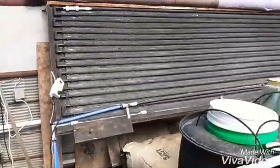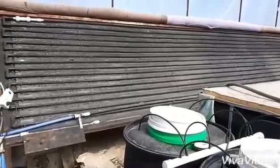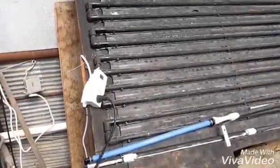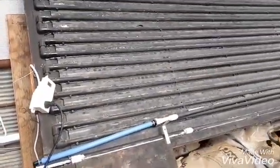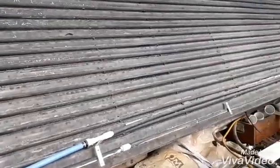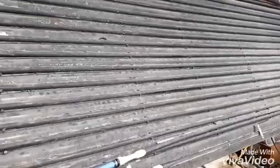This time of year I'm probably only getting about four hours of good sunlight back here on this array. But I'm really happy with that. I'm just running the pump, so it's pretty much free. And these are CPVC pipes — if you look at other videos, they're just screwed onto some galvanized steel roofing material, with caulking on there to make better adhesive and conduct the temperature better into the pipes. Then everything's just sprayed black.